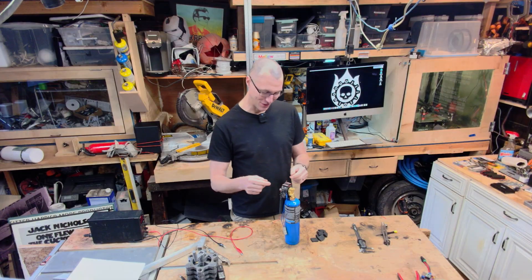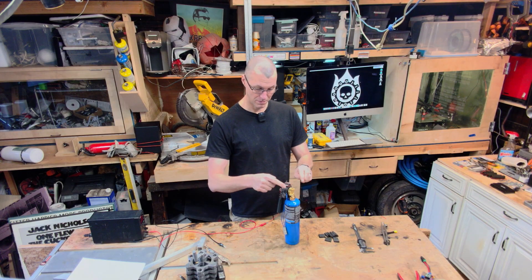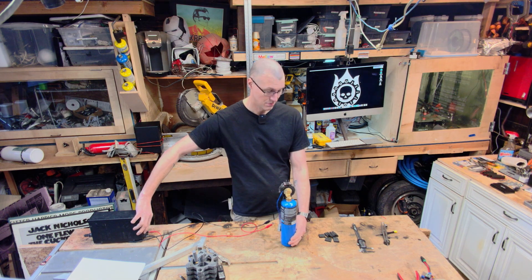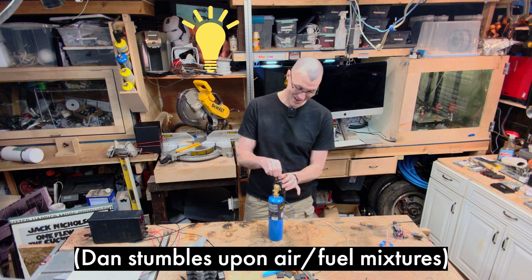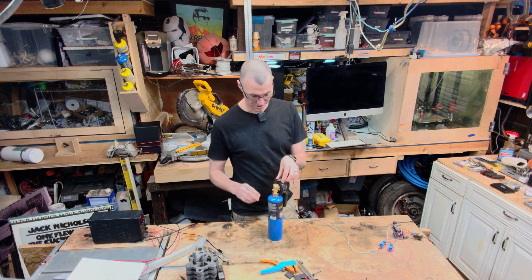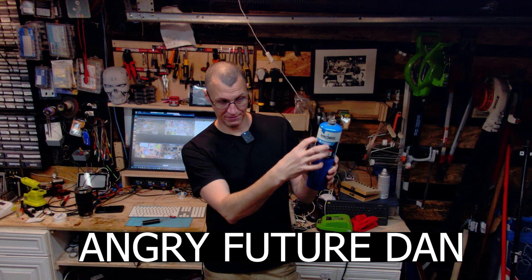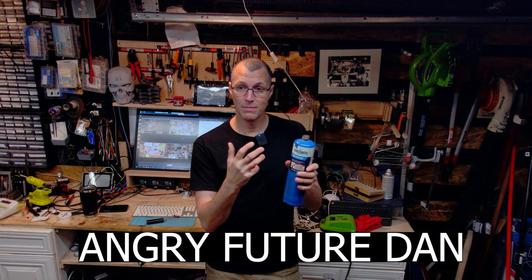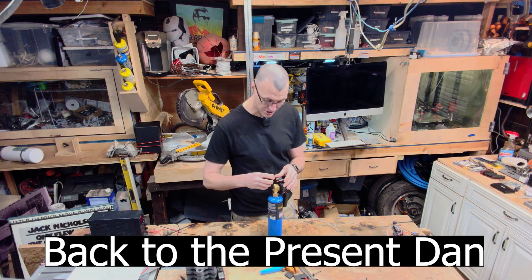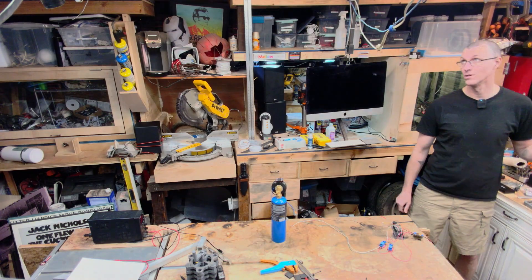This is my test jig. I originally thought I'd just use something metal, but metal conducts electricity, so I'm going to use this instead. I made a bunch of little spacers so I can raise or lower it and make the spark gap wider or narrower. The arc is loud, but the first attempt didn't work — not enough air mixing. That's why I made these adjustable doodads. The air-fuel mixture isn't always the same: there's liquid propane that turns into gas, and every time the liquid fills in it turns to gas, which needs heat. So the canister gets colder, the gas is colder, and the energy in the gas can be much less than when it's warm. I should find the best air-fuel mixture. That's pretty cool — I got one working.